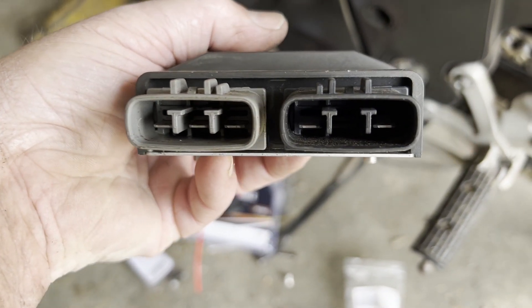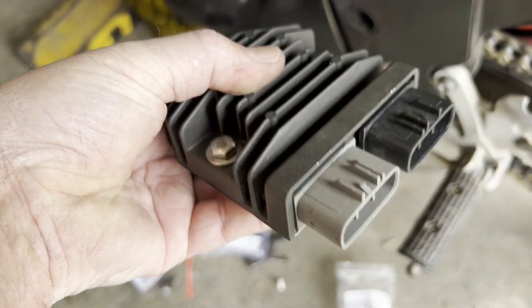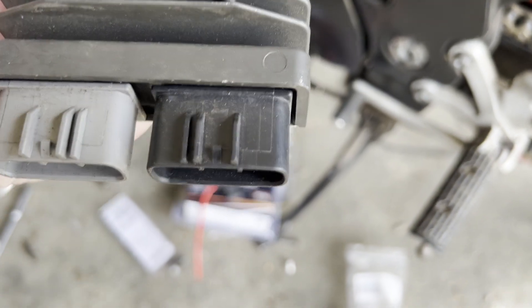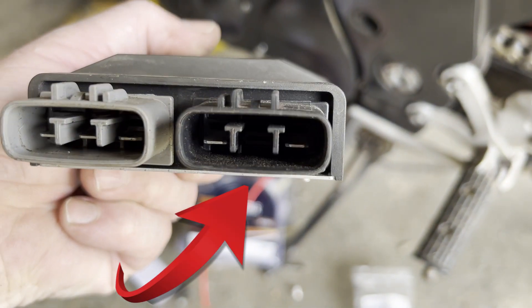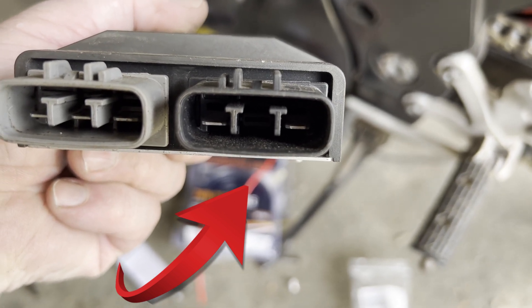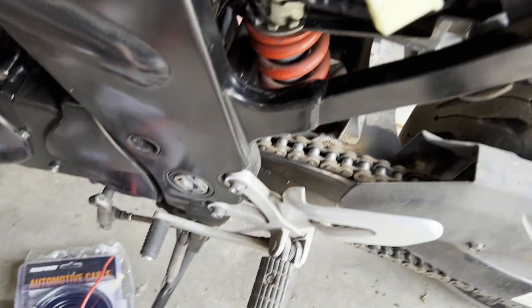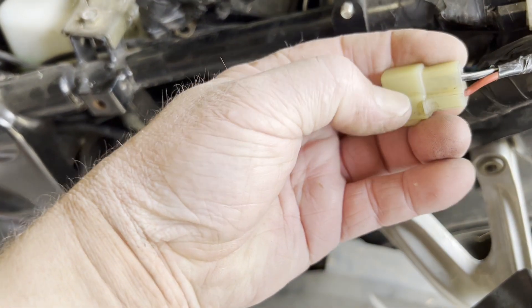Once it's completed, going from AC and being regulated and rectified, it pops out this side in the dark gray as your 12-volt side. The left tab is your positive and your right tab is negative.